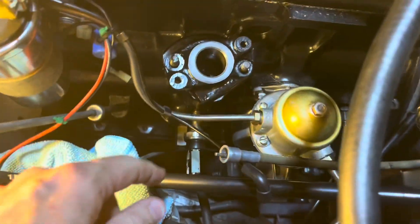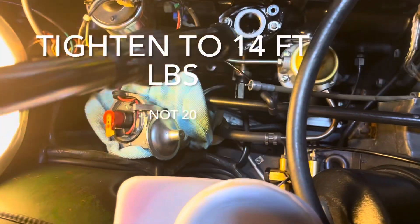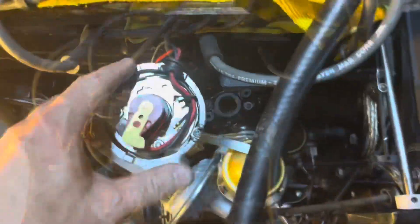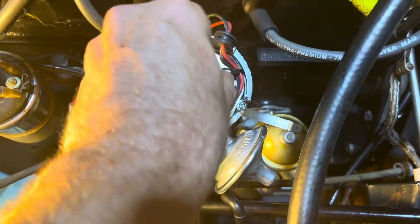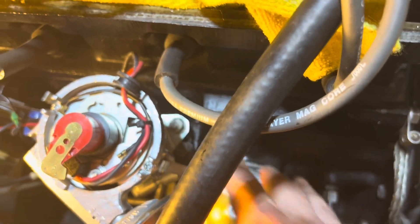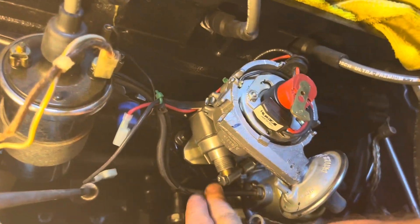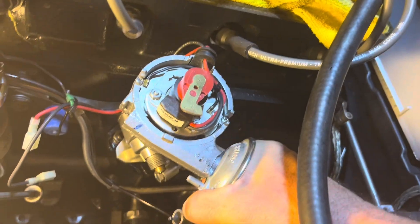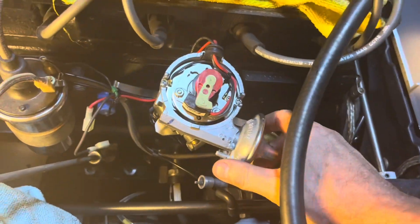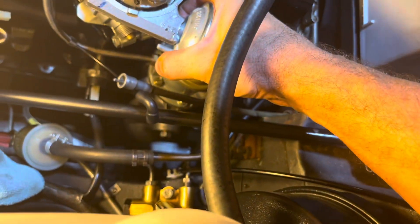There we go — there's your torque wrench. Tighten those to 20 foot-pounds. I'm going to have to turn the rotor a little bit — there it goes, I feel it drop into the slot. Now you can tell it's in the slots and it's not moving. Put the little bolt back here and tighten it down by hand. You want to loosen up your adjusting bolt so you should be able to move this now.